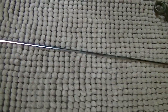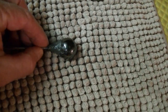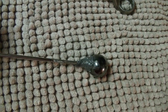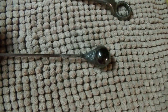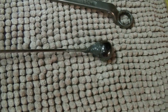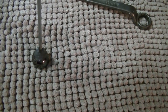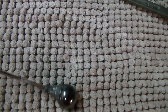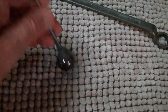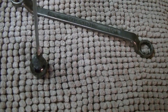So I had this nice steel rod that I had used for an extension screwdriver. You can see this is filed off here. I had made a flat-point screwdriver tip out of this and was using it for carburetor adjustment a long time ago. So I got one of these new kind of magnets, made a ball of JB Weld, and stuck it on there. I didn't prep the magnet at all — I just kind of got the JB Weld stuck on the magnet and then made a ball out of it.